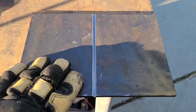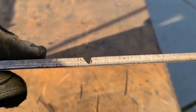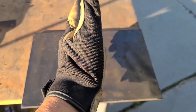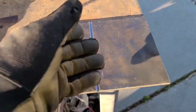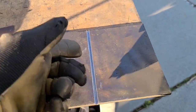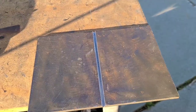With a wider blade I was able to open up this groove — you can see the angle in this groove. Even then it's not enough, because as I fold this plate over the groove is going to get smaller. So I'm going to make more cuts to open it up, because I need this groove to be open so it will allow me to feed the weld in there to make it strong.